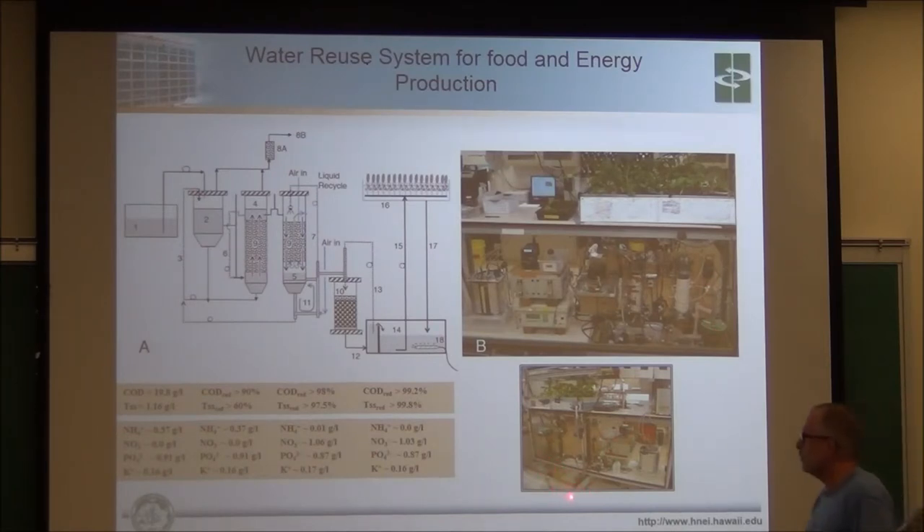If you go down to the lab right now and look at it, you'll see that the water we're actually producing is clear, with virtually no solids. You have to be a little careful about how you have the outlet coming into the trickling filter, because you don't want to over-flood it with high-strength wastewater. We are going at a much lower flow rate. The HRT is now about five to seven days. I am now working on packing materials that are even better than the biochar — a new way to bring biochar into the system. We're putting biochar in the bed and can get more surface area, making these systems work much faster.